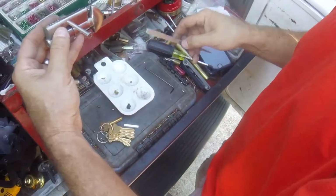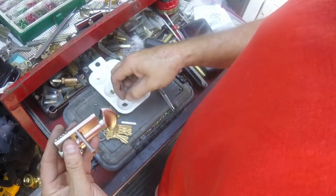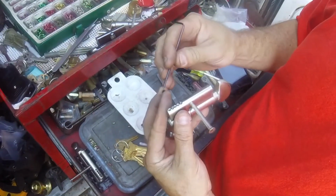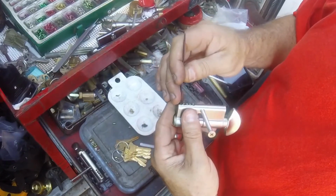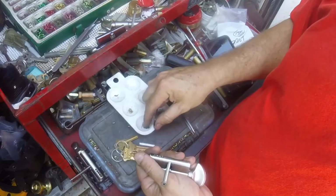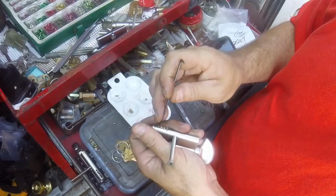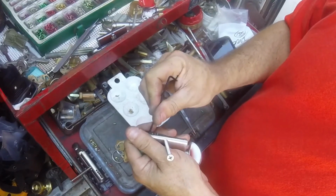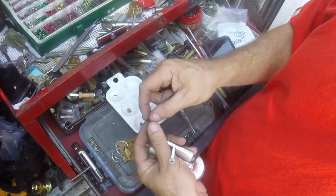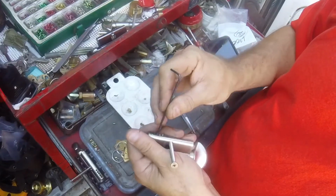1 or 1.5 year old passage lever, cylindrical lever handle that is not opening from a patient room. The maintenance crew, who doesn't do locks, I do all their locks, but they call me for most everything, but they try to handle it themselves. But this one is apparently not opening from the outside. The latch plunger, he called it the plunger, the latch is not retracting. It's just a passage cylindrical lever, Corbin Russwin, brand new.